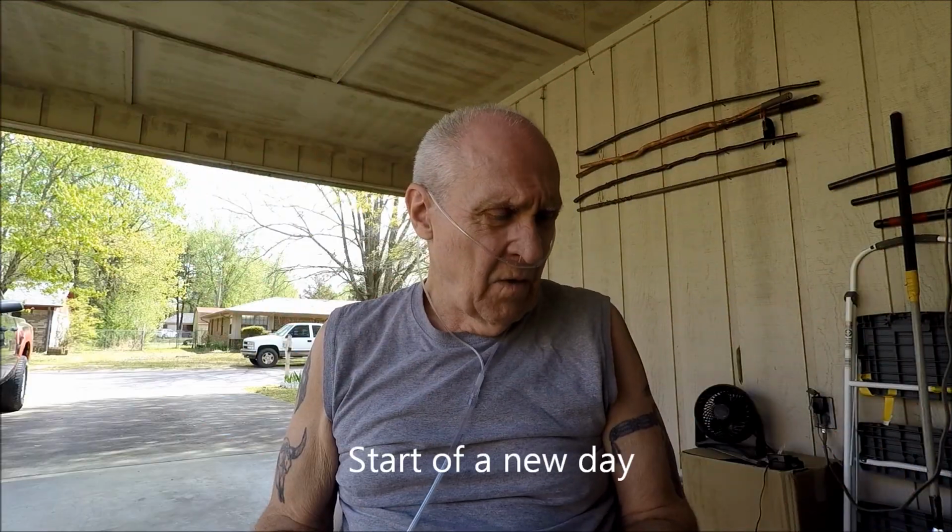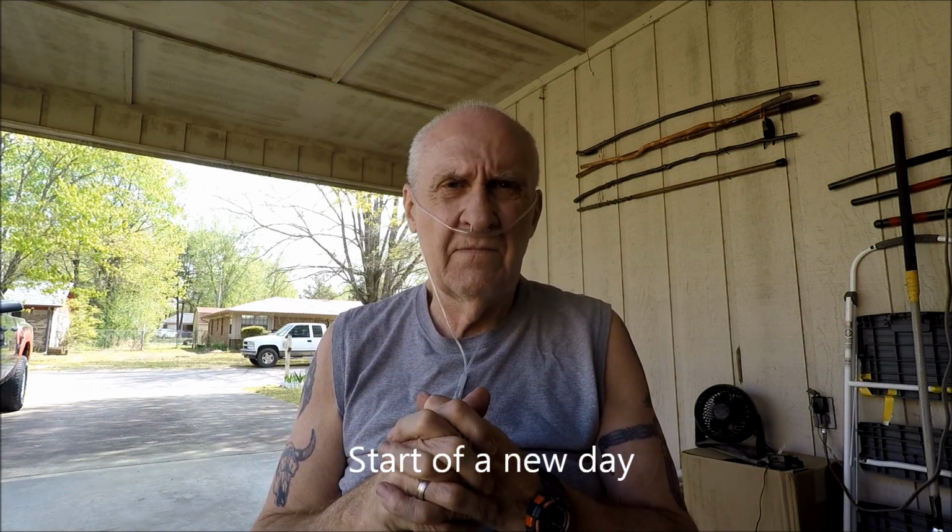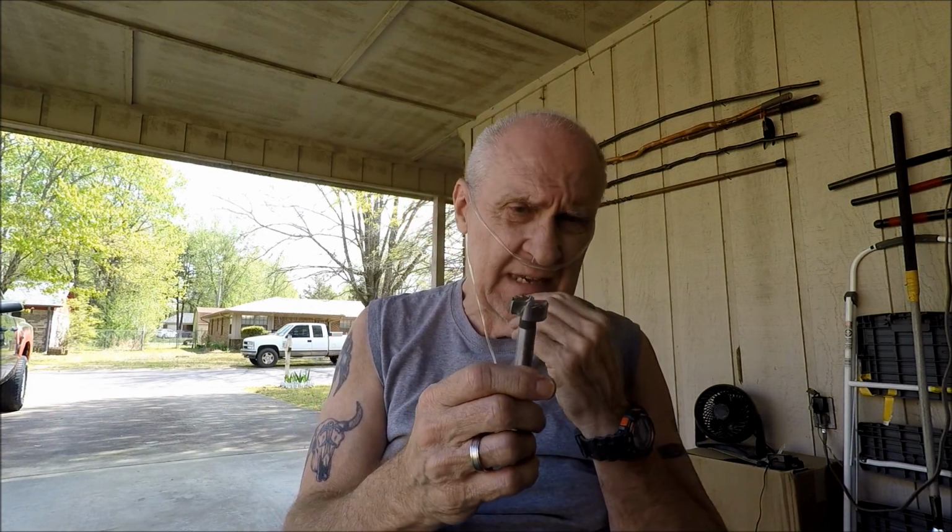Okay. What I'm going to do today is I'm going to continue with the Aspen walking stick with the snake on it. But what I'm going to do today, other than fighting traffic noise and stuff out here, as it's such beautiful weather now, I'm going to cut the end of the walking stick off, and then I'm going to countersink the end with, I guess it's pronounced Forstner bits. And I think I said before it was a 22 millimeter, and that's wrong. It's 25 millimeter compass.